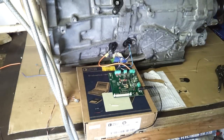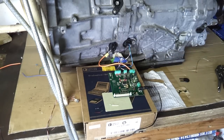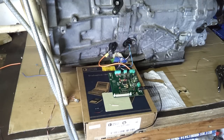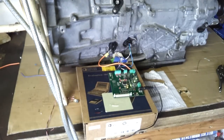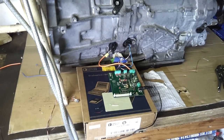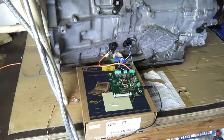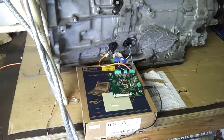This eval board does have facility for simple RC filtering, and I've played around with resistor-capacitor filter values. Most of the time they create more problems than they solve because they introduce phase shift into the signals — and that's not a good thing when you're measuring phase. So I'm going to set up the oscilloscope and let you guys look at the signals both when I turn the shaft manually and when we run it with the inverter powered on.